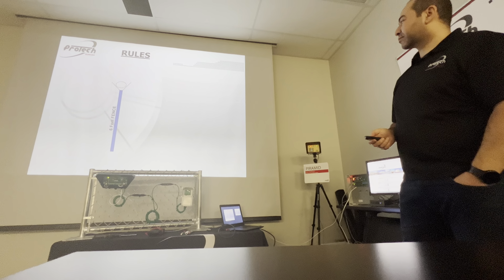Technical characteristics of the tower: 'Intrusion' means someone has cut at least two adjacent beams at the same time. 'Disqualification' means one of the cells along the beam height has been obstructed — for example, by a truck parked between the transmitter and receiver for more than 60 seconds (one minute) — triggering a disqualification alert. 'Tamper protection' activates when the plastic cover on the unit is opened.